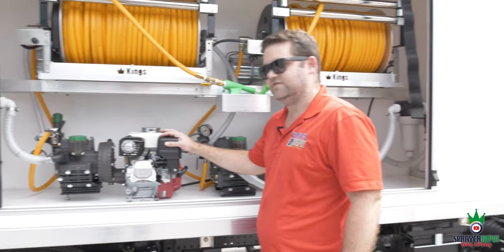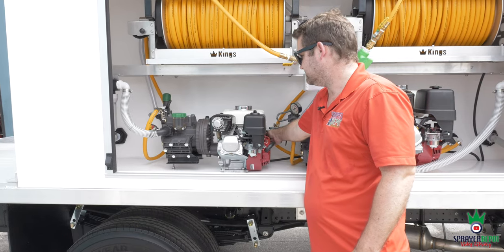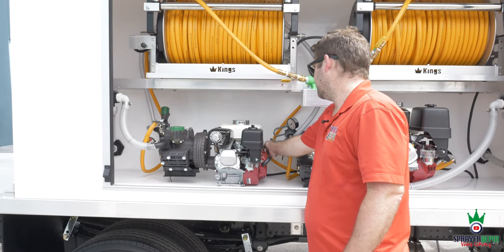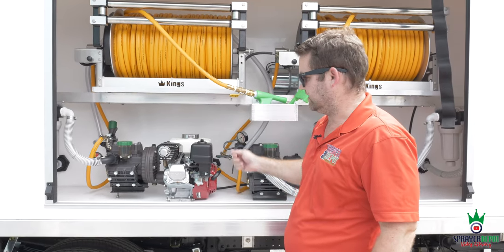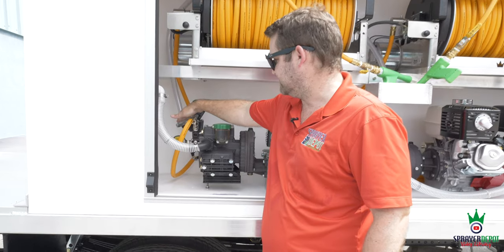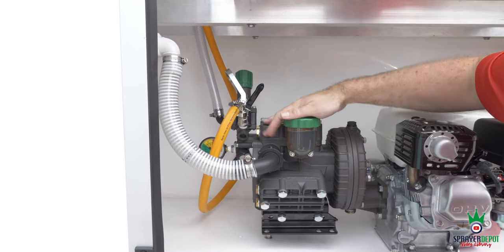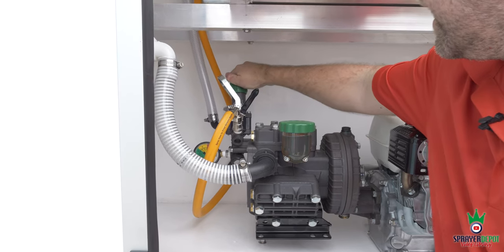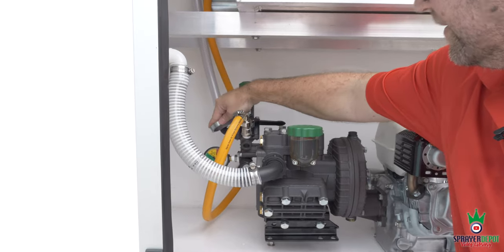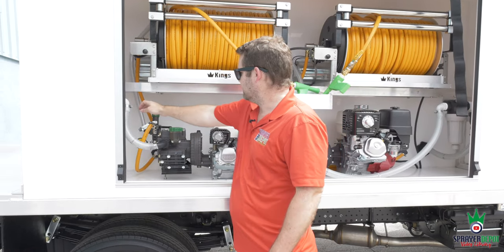The Kappa 55 is the same thing but with a smaller engine. Let me start it to show how easy it is — just turning the key. Throttle up a little bit. Simple — no cord, just turn the key to start. This regulator is a little different in design but the same principle: when the lever is down, you're in bypass mode. It should always be in that position when you start up or shut off. This is how you adjust pressure — but you don't do that until you're in pressure mode. To spray a lawn at 100 PSI, dial it in and start spraying.